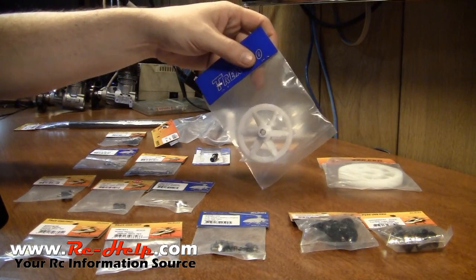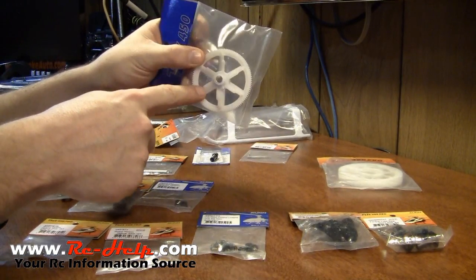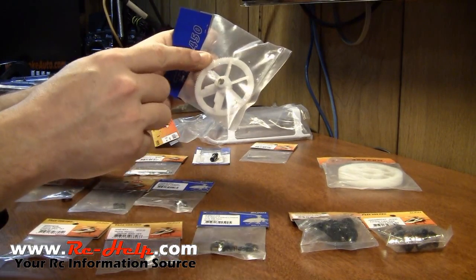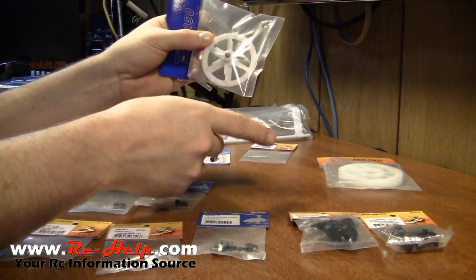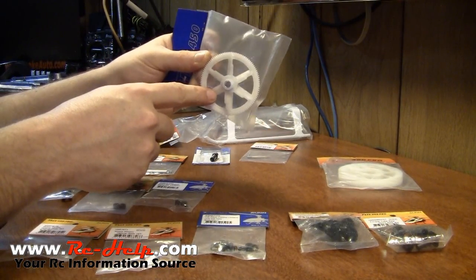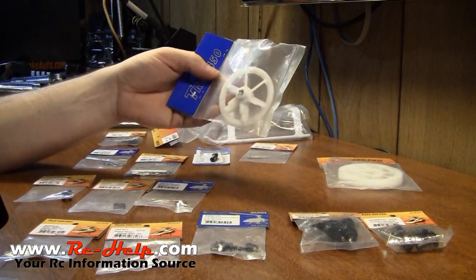This right here is the auto rotation gear. It's just the standard auto rotation gear, and the reason I want this, these have the real steep cooling fins, and I noticed on my HK450 GT that with these coupled with the fins on the main gear actually keeps my motor cooler. So I wanted to run these, plus it's Align. You know that they're not going to be warped.